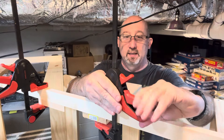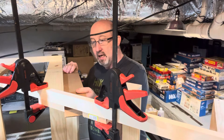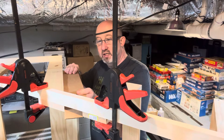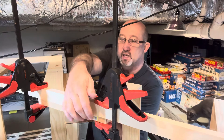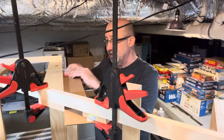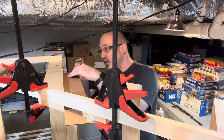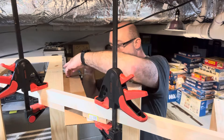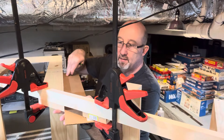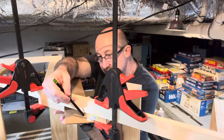I'll reclamp that to give myself a little more room. I'm going to set it up on top here, line this edge against this edge — because this is the break point — then slide it forward. You can see it just clears out here. Now that I've got that in place, I'm going to hold it back here and draw a line to show where this cut is going to be. Then I'm going to take a couple of quick marks — one right here where it meets this piece.